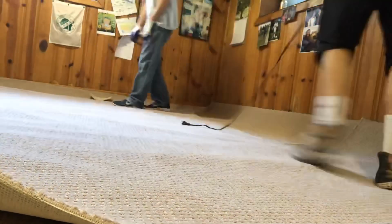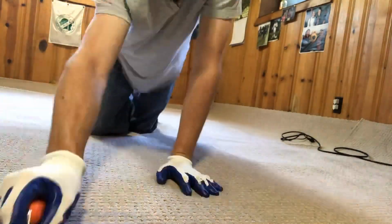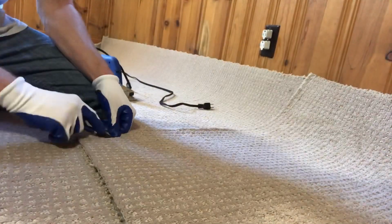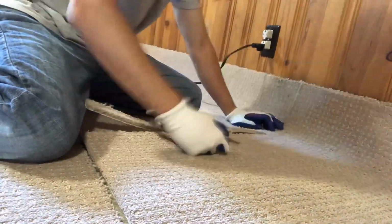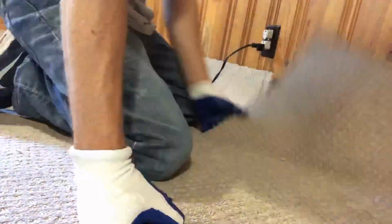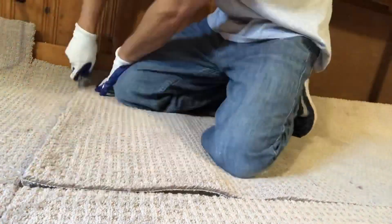We're going to go ahead and unroll our fill piece. We are running rows. I'm taking a pin down there right in between the squares and running rows down. Now I'm taking a top cutter and cutting a nice clean edge on it. Here's a cross seam. Same exact scenario, just feeling out a row on it with the top cutter. See how I do that? Boop, boop, boop. And then I cut it. Lob that off. Life is good.